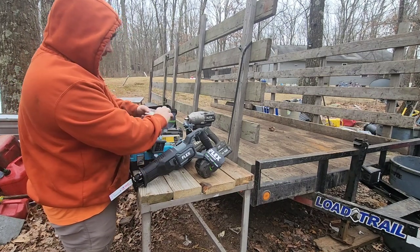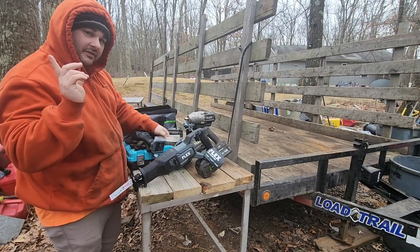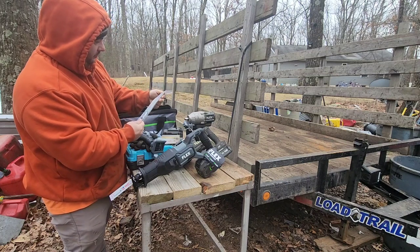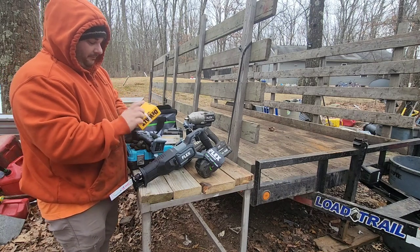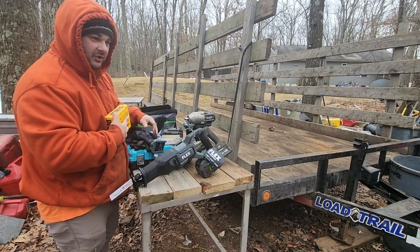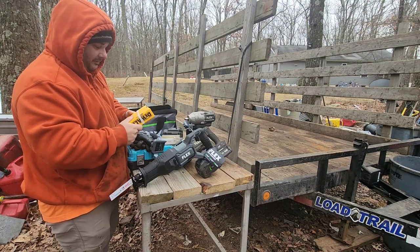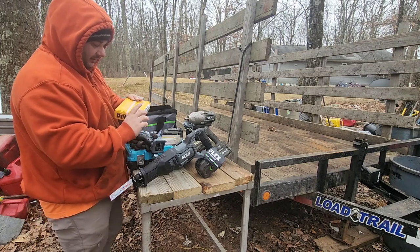I'm going to be using the Milwaukee Torch blades for cutting the frame. They also gave you a bimetal blade and a big giant wood blade, but I'm not going to be using them. And I just ordered a 100 pack of DeWalt Sawzall blades. I like the Milwaukee Torch blades, but they're not good for cutting copper. The teeth are too thick on them, and it cuts, but it usually rips the copper apart too much. It causes too much vibration. So I use the little DeWalt ones as much as I can, just the yellow ones, not the black ones.